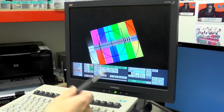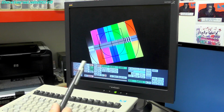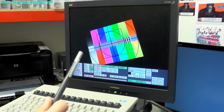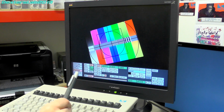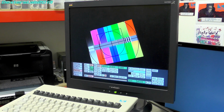Managed to get a replacement for the STV1601 SDI serializers. That's great news because I know of another Ramcorder and a Paintbox that potentially have bad ones. So there's definitely scope for replacing those with those CLC 020s. And yeah, I've got my Ramcorder working again, which is great news.